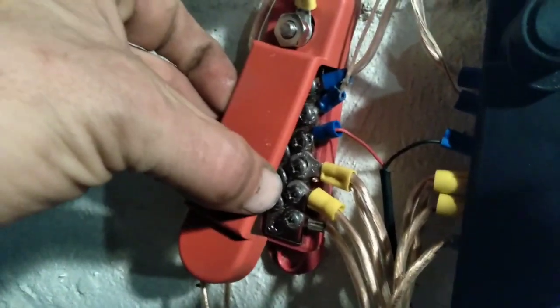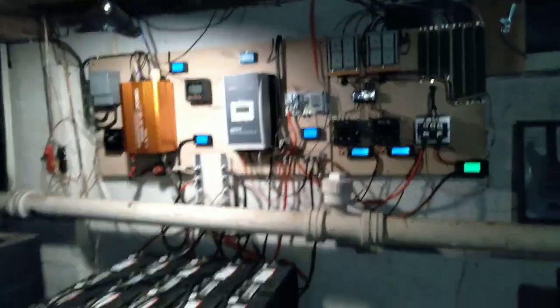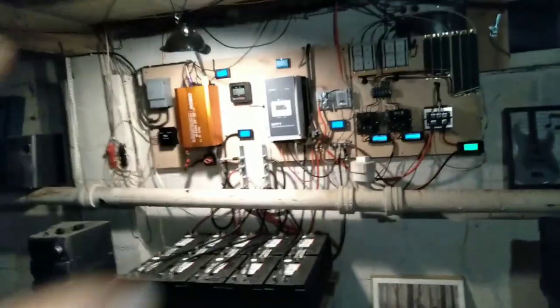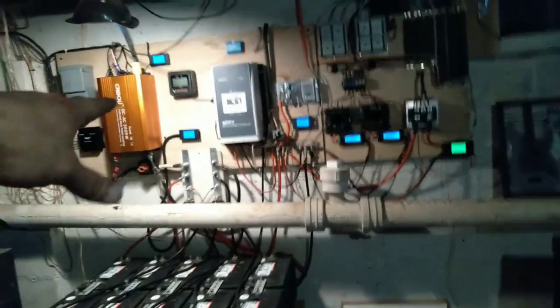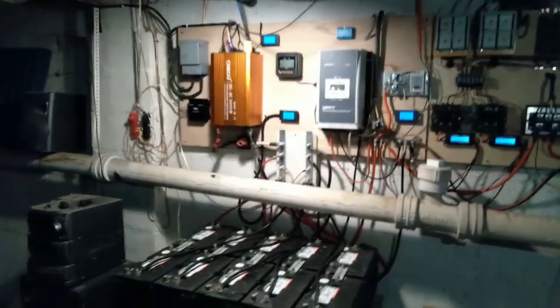But it's on insulated ring connectors, and you will end up having quite a few of these little loads. The more clever you start getting, you think of all kinds of things. There's DC TVs, there's DC fridges. The more you can run without having to run your inverter, the more you'll save. Because, like we just figured out, that's 85% efficient. So that means 15% of the power that goes into that is just gone. It's just gone in inversion.